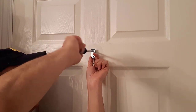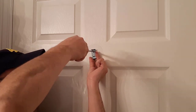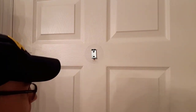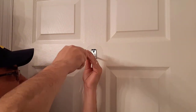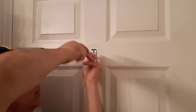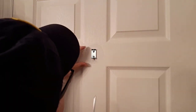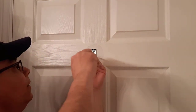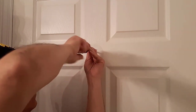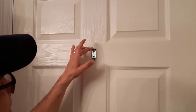Now we're going to put the bracket into these anchors. What's going to happen is you drive the screw in, it hits the bottom of the anchor, comes to a stop and locks through. We'll put this one in and line it up — make sure it's level vertically — just line that up by eye, that's good. Make sure it doesn't move — yep, that's good.